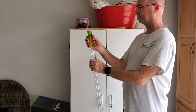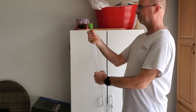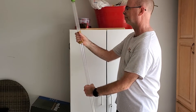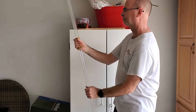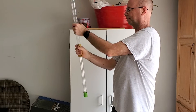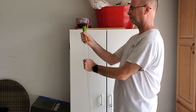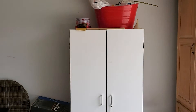For the clear tubes, I decided to lightly scuff up the surface with 220-grit sandpaper — very lightly, just to rough the surface enough to give the paint something to stick to. I applied masking tape at the very top and bottom where these go into the 3D-printed parts. I found this technique worked much better than trying to paint without it.